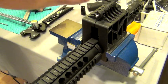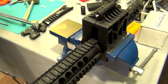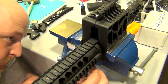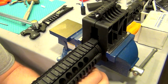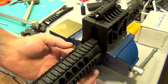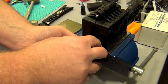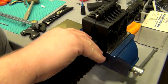All right, it also tells me to take some blue Loctite and put it on the vibration screw. I'm going to try and catch it from the bottom. This screw has no torque setting — it says tighten by hand or finger tight only. I'm going to snug this locking nut here by hand once I feel I have everything lined up. Like so — it feels good, it looks good.